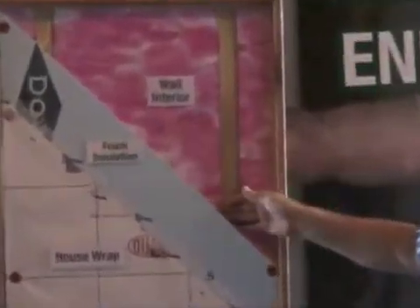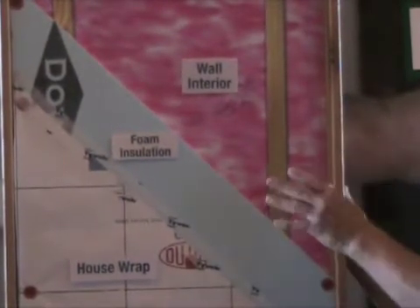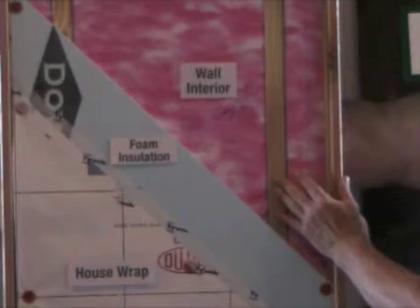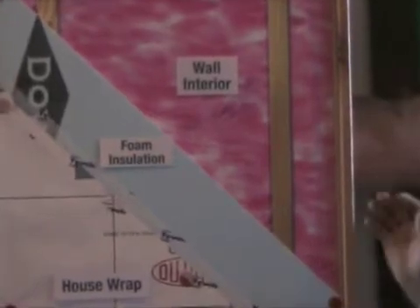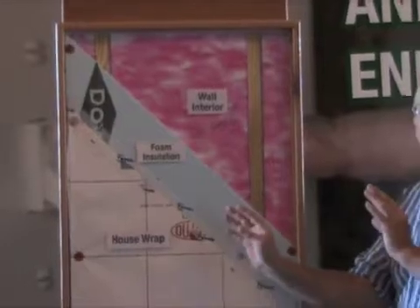Like we've mentioned in the other exterior construction one, you can sheet the outside with OSB and cover with foam if you want the extra structural strength. Usually what we do though is not put any OSB or plywood on the outside of the framing, but use two inch metal wind bracing and run at least two in each corner — two going one way and two the other, 90 degrees to that.